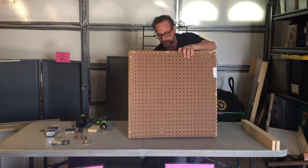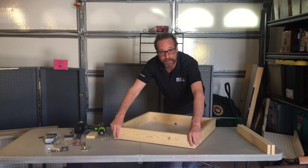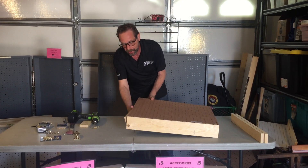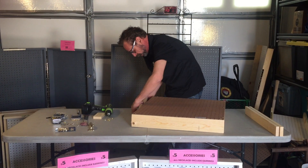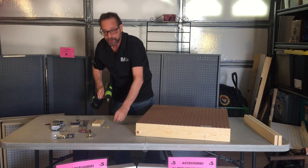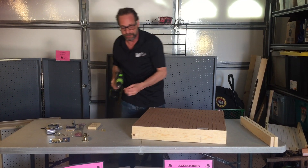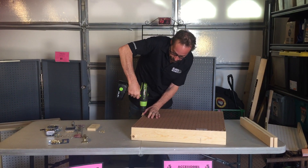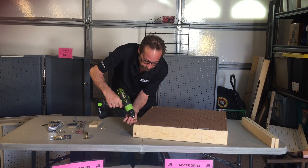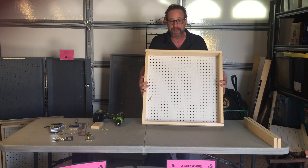Take your box and put your last piece on the short sides — the 22 and a half inch sides. Put it on the inside of the box like this, and because you've left that extra space, you're going to be able to adjust this at the side to make it work for you. The procedure is the same way: put this down on its side with the white in the same way you did the long sides, then do the short side. Line it up very simply, make sure you've drilled your pilot holes. I still like to use three pilot holes on this side. By the time you've got your three screws on each side and duplicated the process, you have one half of your display and it's ready to go.